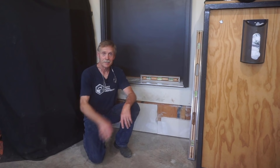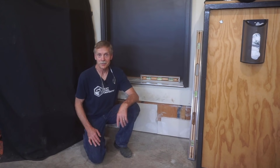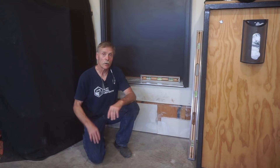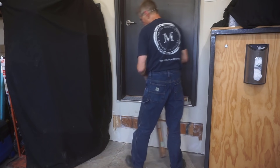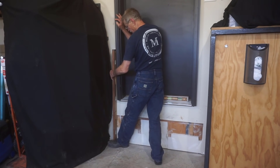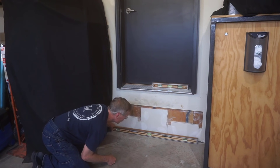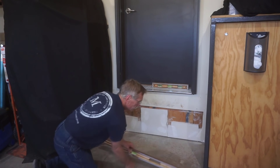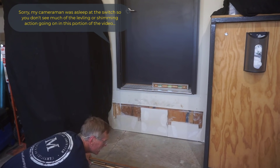Compared to the conglomeration I just tore out, this stair box is a pretty simple affair — with a whole lot fewer fasteners. I pre-check existing conditions with a four-foot level before sliding the box over to shim it up. The wall looks dead plumb, so I should just have to do an even scribe off the back. There's a little hump at the control joint — looks like it goes from nothing to a quarter inch — so I know what to expect there.